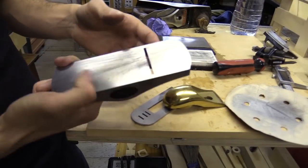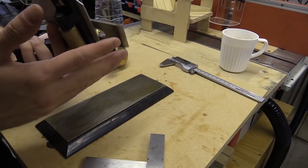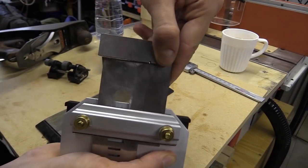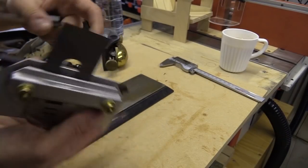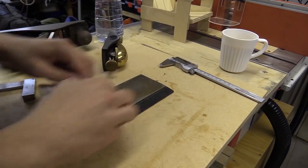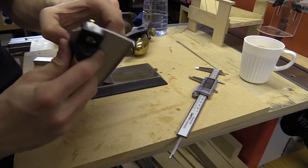I also sharpened the plane iron for my low angle block plane — the one that I scuppered the block a little while ago. When I originally sharpened it I used this honing guide which clamped from the top. It's a bit difficult to use because it doesn't self-align and the lower rolling wheel underneath doesn't pivot, so you can't compensate while sharpening if you're off a little. You can see if I place this across there that I haven't done a great job — there's a fair bit of material that needs to be taken off this side. I tried loosening the clamps and placing an engineer's square against the front edge of the honing guide with the square edge against the side of the plane, but when I sharpened I could tell I was taking off material unevenly. You can see why people don't like this particular one — it's really hard to get the thing square. I'm wondering whether I can make a little modification to it.